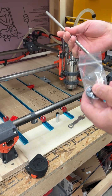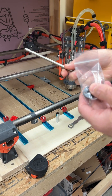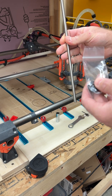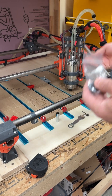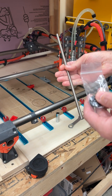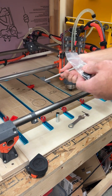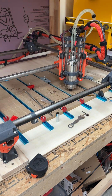I don't find that to be super critical. I know for 3D carving, having a faster and more rigid Z can make life better since it's able to raise and lower a little faster. My understanding is that by switching to this lead screw, it should prevent that drop. Once I power up the steppers, home the machine, Z's at the top, and if I then disable the steppers, the extra resistance from the lead screw should keep the axis from falling. So I'm going to switch to a quick time-lapse and get to work on that, and we'll touch base after I've done the swap.